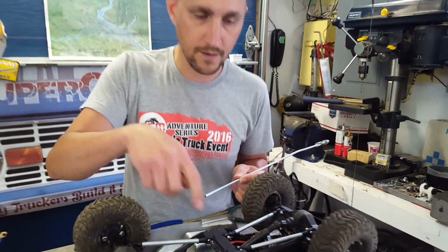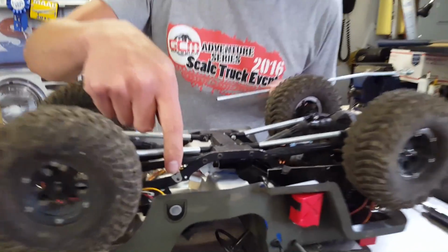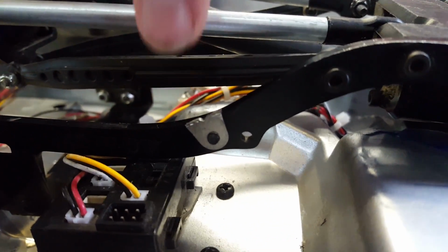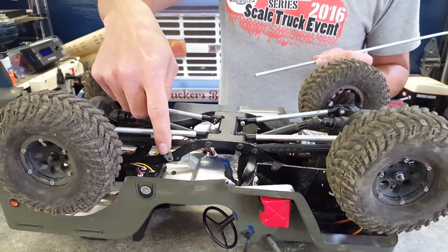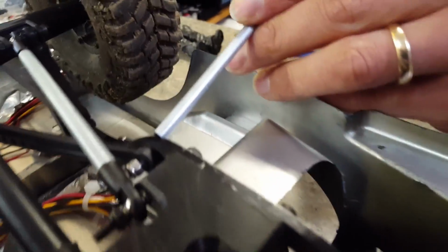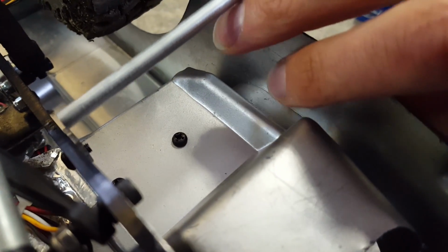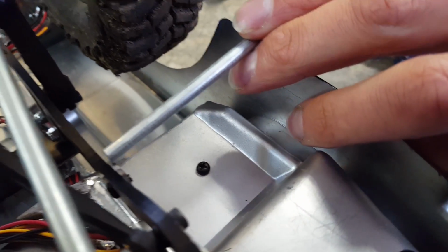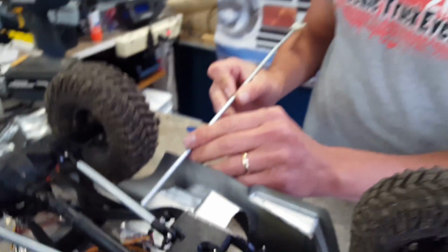But we have these fantastic little mounting tabs that we're going to use. These are from scalarfab.com. And these little tabs allow us to weld the tube right onto the tab. So instead of having to use the end of the tube on the frame like this, we're going to actually be able to weld the tube onto the tab. And that little gouge in there is to make sure the tube is in the center of that? It just helps you to locate it.